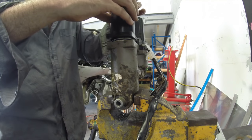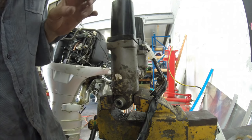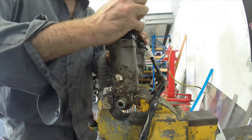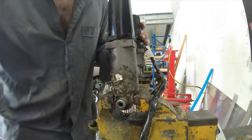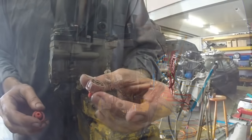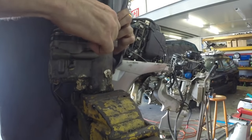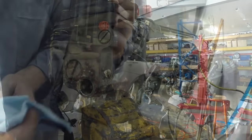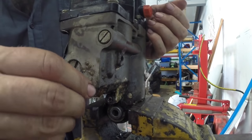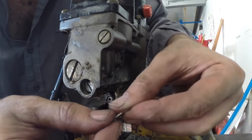I'll start by putting this reservoir container back on. I'm just going to push down holding on to that bit of plastic holding the oil seal in, just to make sure that didn't pop up. Then just these four fasteners with the allen keys. Now although this is a Honda 30, a lot of these principles will apply to just about any outboard you come across. This is the old plug — we're now going to put the new plug which has a brand new o-ring in it. Hopefully that's nicely sealed up now. And then we've got our drain screw mechanism with new o-rings, and we'll just wind this in. Once that's in far enough we've got the fun of trying to get our circlip back in without pliers — wish me luck.